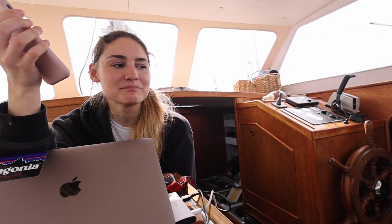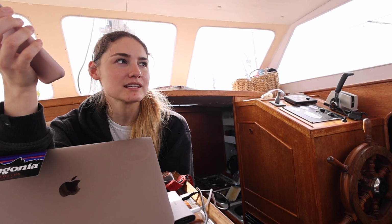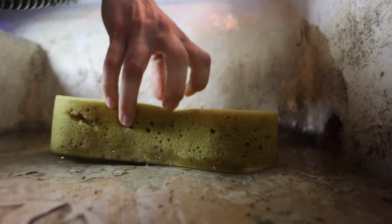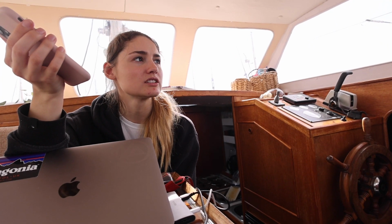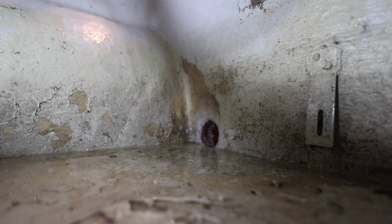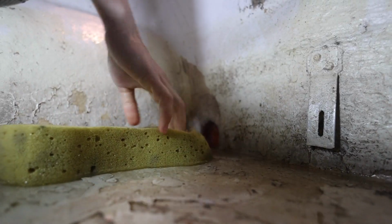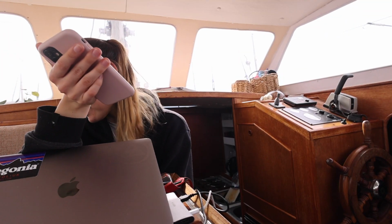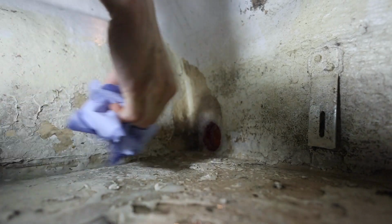But it was so annoying, because we spent all that time getting it perfect, and then we left it 12 hours, and it says that you leave it for 48, and then I added some more epoxy because it was still dry by this morning, and then literally an hour later I went to check on it and it was sitting in water. That's okay, that's fine. Do you think? Okay, so the first layer of epoxy that you put on had cured. It's been there for 12 hours, yeah? Yeah. Don't worry about it. I've done epoxy boat repairs underwater before now, and they've held. Okay, that makes me feel a lot better. Yeah, don't get stressed. The worst case scenario is you sand it back and do another bit. It's not the end of the world.